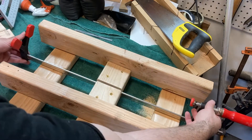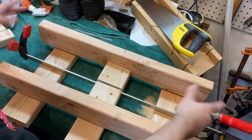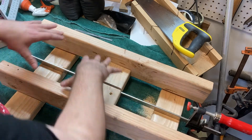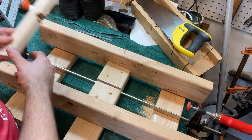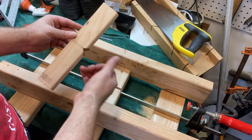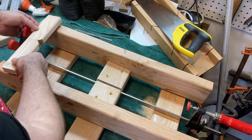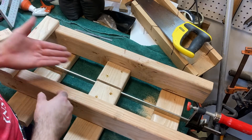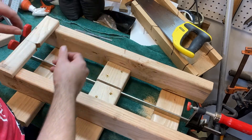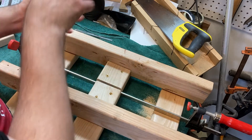I've got these two pieces of wood with just enough space in between them to hold this three-point clamp upright, and I've got a little piece of wood here that's got a little notch cut out of it in a triangle, so it's able to make two contact points with a round surface to apply pressure to the bottom of the heel of the neck so that it seats correctly at the correct angle and nicely faced with the body.